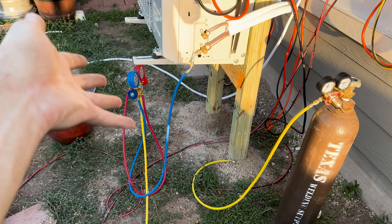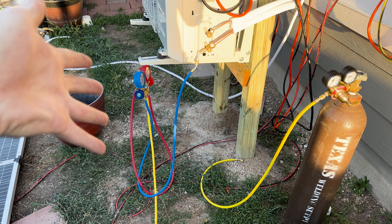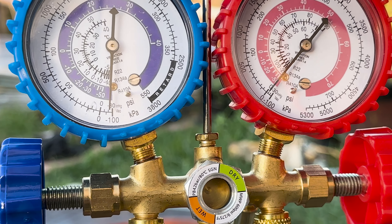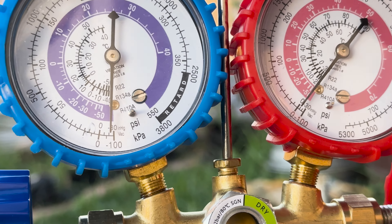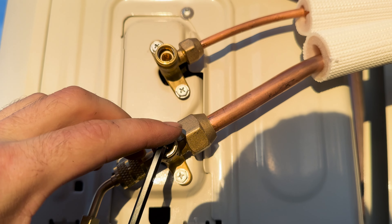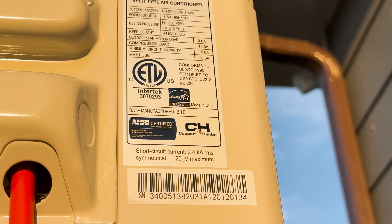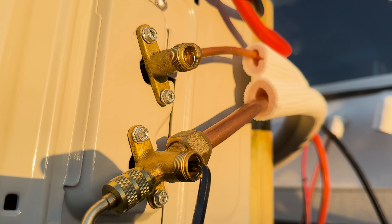You do this step after you're sure your system is pressure tight. Once you get down to desired suction, shut the vacuum pump off and let it sit to make sure the vacuum doesn't drop. If we're good there, we can disconnect everything and release the gas — there's a specific way to do that because there's a Schrader valve and we don't want to let air in. We got it down to almost negative 30 inches, which seems to be the farthest my pump will pull it. Now I'm going to let this sit to make sure it doesn't move. If it doesn't move, we are good to release the refrigerant. All you do is stick an Allen wrench in and untwist. If you ever have a leak and need to recharge it, you'll have to completely evacuate the system and add 40 ounces of R410A. This is pretty much the scariest part of the install, but as long as you take your time and pay attention, I think you guys can get it done.